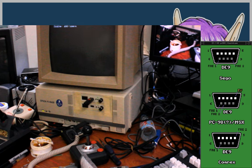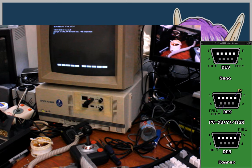So I just poked against the DC barrel connector by mistake while searching for a ground point. Voltage. Now I'm measuring voltage again instead of continuity. So there's about 3.7 volts between pin 9 and pin 8, with pin 9 being connected to ground, and pin 8 being positive. Interesting.